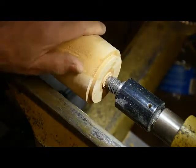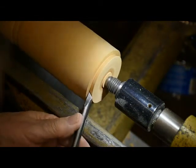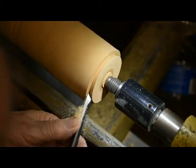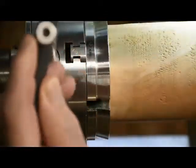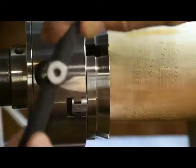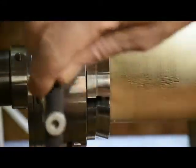You may notice I have a hollow in the middle of my straight edge, which means I need to take some more off on the outer edge. Wood compresses, so it's very important when tightening to use a little pressure on each pinion and then gradually increase as you go around the chuck tightening.